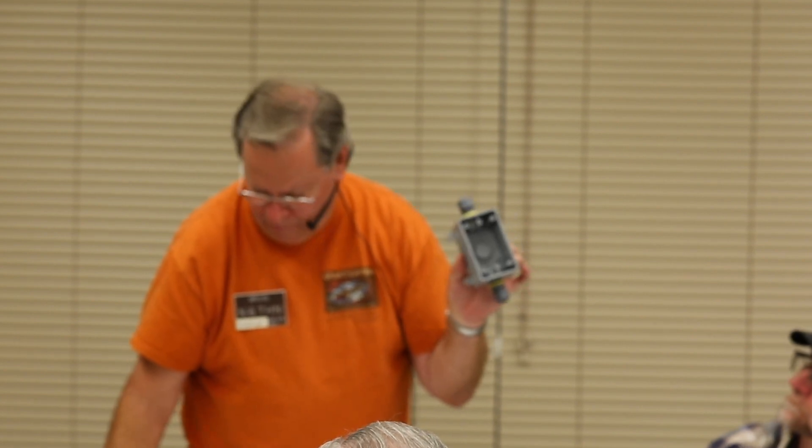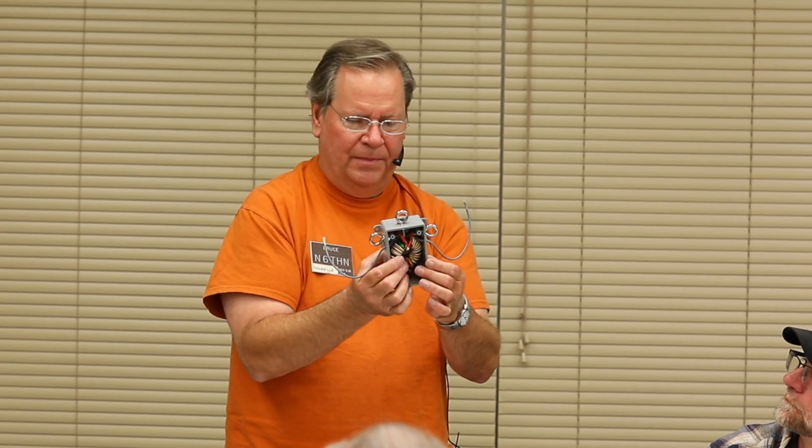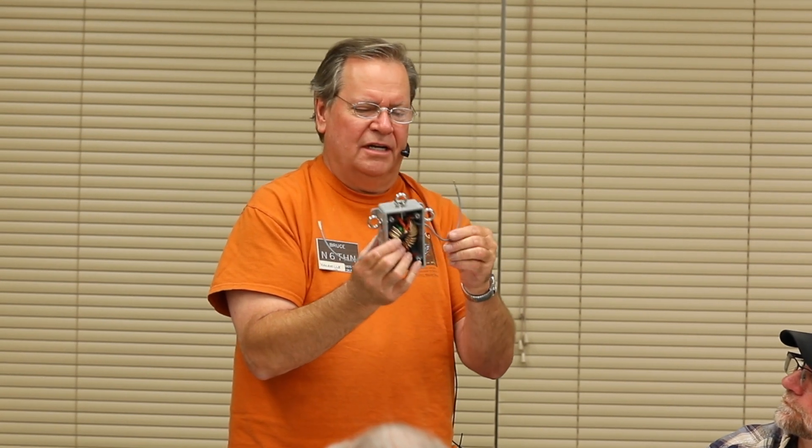This is the stock plastic box — it's going to fit in there, the cover goes on, I hook up some wires, and I'll have a second one. This one is ready to go; I just have to put the cover on. These are Teflon wires. I did the match test: I put a match under standard house wire and it turned black immediately and burst into flames. With Teflon wire under the same 10 seconds of match, you can barely see a little brown spot. So the insulation on this one is Teflon; the other is PVC — PVC is a no-go.